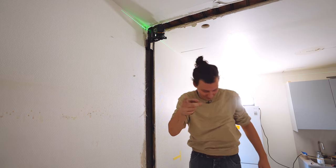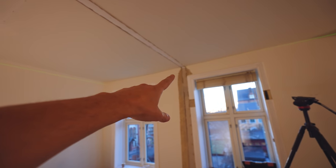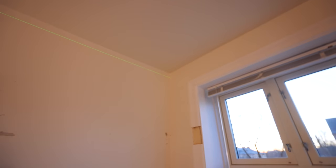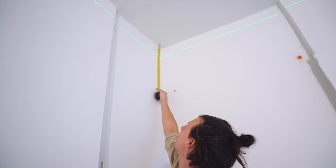Let me show you something. The building in general has sunken a fair bit out towards the street, which is over there. I've now made it so that the laser line touches the lowest point in the ceiling, right where that wall used to be. Just a few meters over from that, in this corner, that line is now about six and a half centimeters down from the ceiling, which means there's a six and a half centimeter height difference in just about two meters. And over in this corner, at the worst, it's 12 centimeters — almost double.